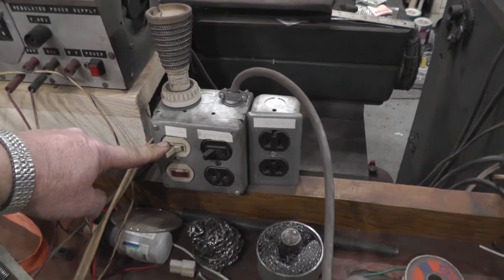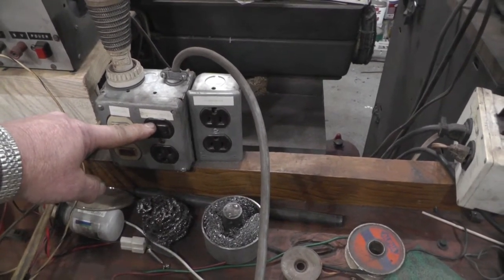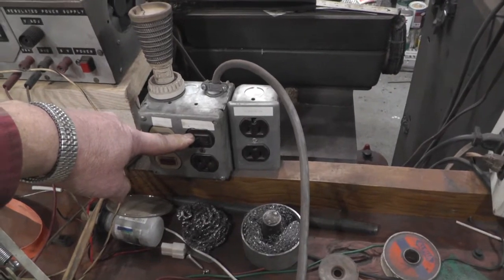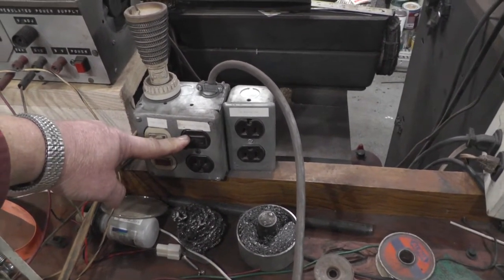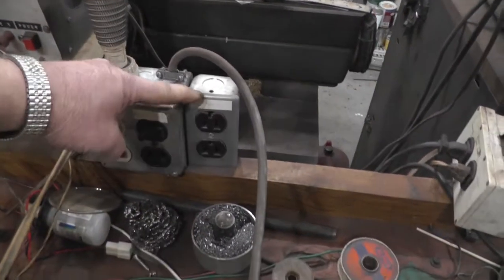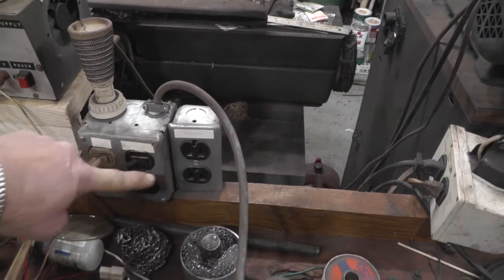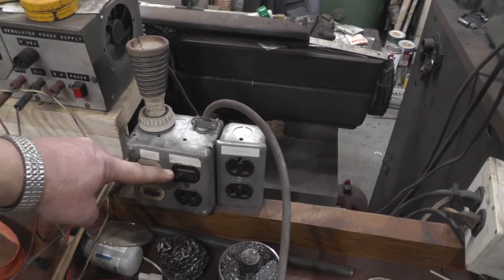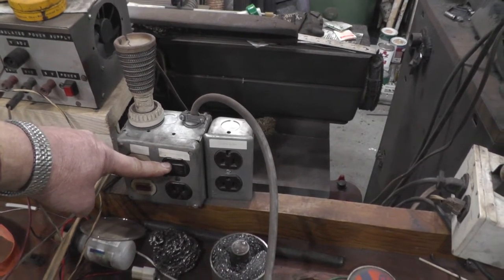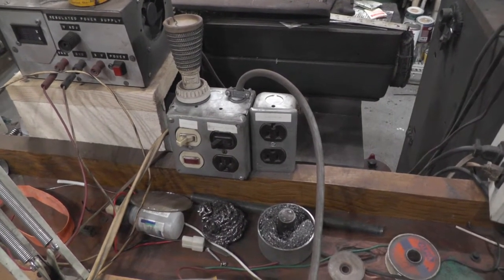This one I just have a switch on this outlet. I thought I had that motor figured out, so I plugged it in here to try it. I turned the switch on, it wasn't right, and it finally killed this switch - it doesn't work anymore, it doesn't shut off. It welded the contacts right together. This one over here is on all the time, which I plug my soldering iron and things like that into. I'm going to move it over and make it always on, and eliminate this broken one because these switches are about twelve dollars each.